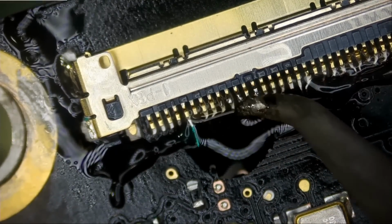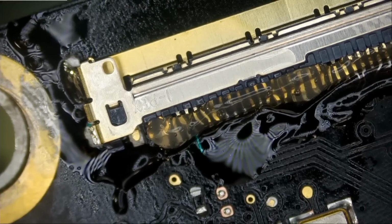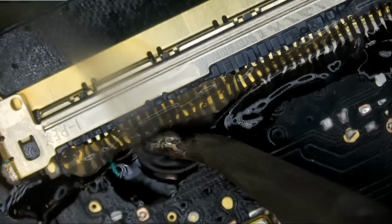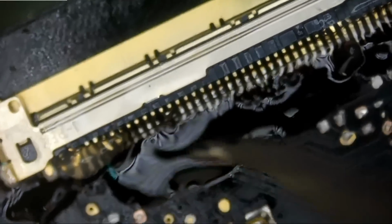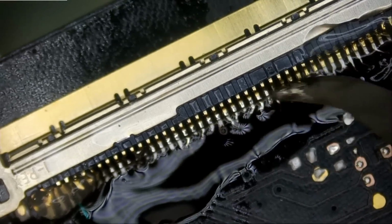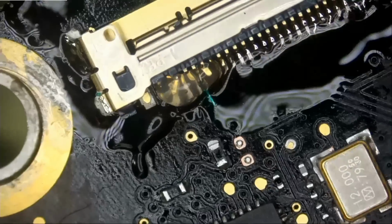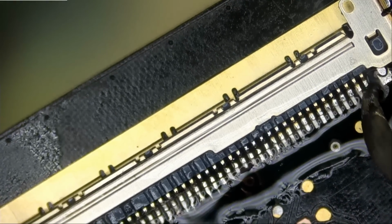And now we're gonna start soldering the front pins. And if you noticed, I'm constantly moving the board around. I want to get to a comfortable position. We're gonna have to apply a lot of flux. Those pins are very close to each other, and they're gonna bridge, but we're gonna fix them. Because right now I have a lot of solder on the tip. A lot of solder compared to how small those pins are. That's what I mean by a lot of solder. Very good.